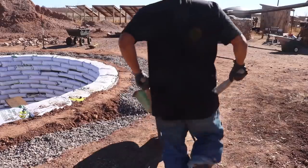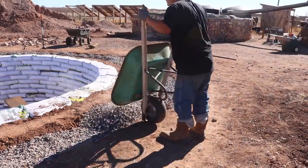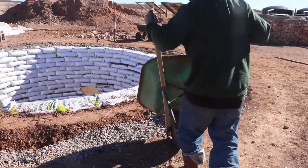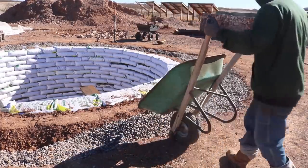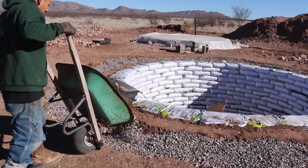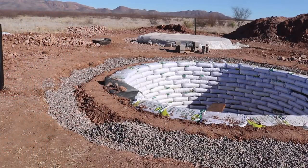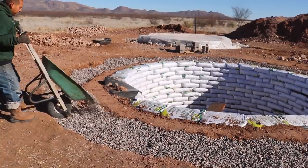In a conventional build, you want a strong foundation, because timber frame constructions are kind of flexible, they kind of move. And usually there's a bunch of pieces that you're attaching together and they're all moving slightly, separately. So you don't want a flexible foundation with a flexible home, because if you get a tremor or an earthquake, that's all gonna come tumbling down. So sturdy foundation, flexible structure.